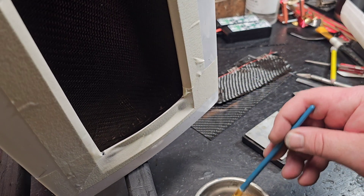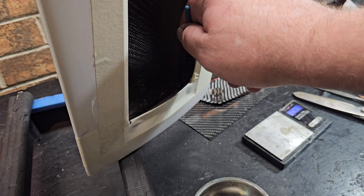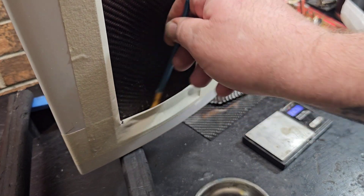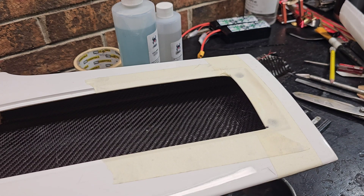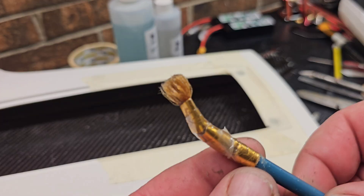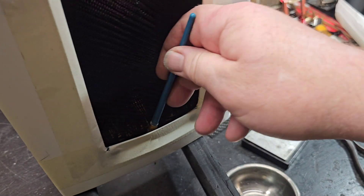Mix it up. Basically just going to wet this transom out. Since we don't have a lot of epoxy, I'm going to go ultra light with this wet-out job — just enough to stick the fabric down. You get your strength from the fabric; epoxy doesn't do anything but stick the fabric down and bond it together. I go super light with my layups nine times out of ten. There are some occasions I go heavy with the epoxy, but not many.